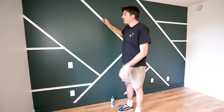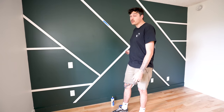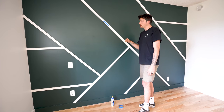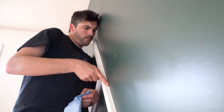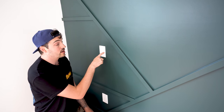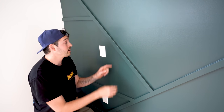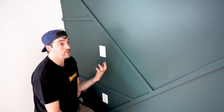All the pieces are securely attached to the wall — they're not going anywhere. I just want to say how easy this wall was to do. Every cut was either a 45-degree angle or a 90-degree, so you could always do this without a mitre saw, though I have one so I'm going to use it. It is a very DIY-friendly feature wall to do. All that's really left is to fill all the pinholes, caulk between the trim and the wall to hide the seam, and paint. It's the next day, the paint has dried, and I'm pretty impressed with how it turned out — really happy especially considering how easy it was. The only thing I might change is the color of the outlets — the white stands out a bit too much. Maybe a black outlet would look better, but that's for another time. Other than that, yeah, I'm pretty happy with how this feature wall turned out.